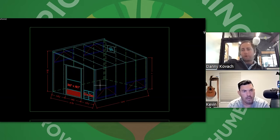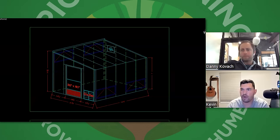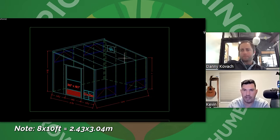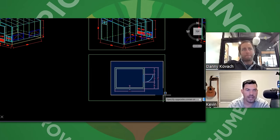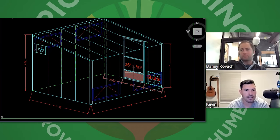The first thing I talked about with Danny was sharing my thoughts on overall size. From my area, you kind of have to consider your permitted or unpermitted structure sizes. For me, eight foot by ten foot doesn't require any permit, which is basically what we sized this — they call it a freestanding lean-to, a single sloped shed roof. Danny helped me see how realistic those thoughts were, translating them into a CAD drawing so I could see renders of the greenhouse from all different angles, playing around with vent placements, heights, dimensions, and materials.